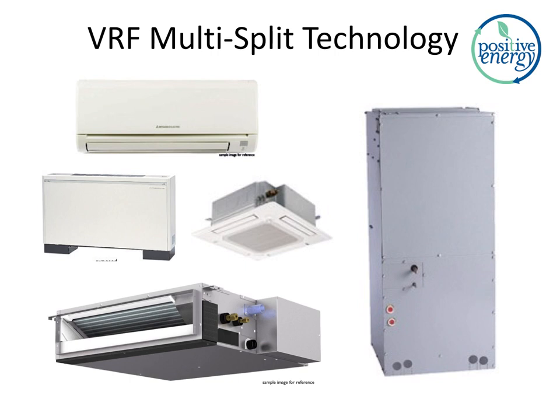We can see some of the space-mounted units there on the top left. At the bottom on the left, we see one that's actually quite interesting. It's called a concealed ducted unit. It's got the form factor of something like 4 pizza boxes stacked up, and the airflow is horizontal through those. Full ducted capability can serve a whole house. We'll be talking more about that in installments 3 and 4.